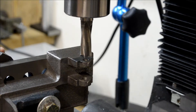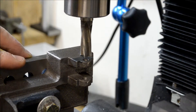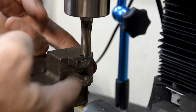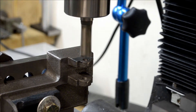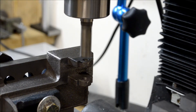I didn't move anything on the table. I just replaced my drill chuck with a half-inch collet. Got this half-inch end mill in here — I'm just gonna touch off on it, then I'll replace the collet with my chuck and center this back with the axle, turning this upside down so it's still on the same center line. I'm just gonna touch off on this and take a very slight facing cut.